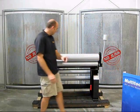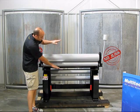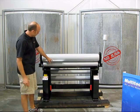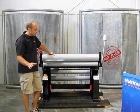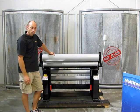You slide the material in between the two rollers. These rollers adjust up and down, so you can put a larger or smaller tube on the top. The bottom roller is used no matter which top tube you use — it stays stationary and purely wraps the material up and around the forming tube.